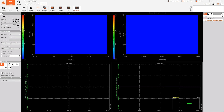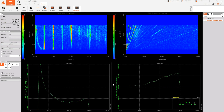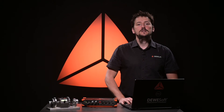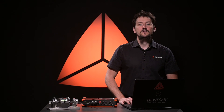All these functionalities in combination with order tracking provide a powerful tool for evaluation of run-ups, coast-downs, natural frequencies, and shaft resonances. In our case, the fluctuation was self-induced and visually apparent. In real life, problems like these originate from within the machine and are hard to see with the naked eye, but can have a massive impact on the performance of your machine.